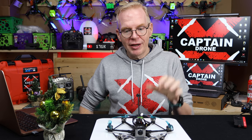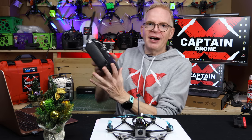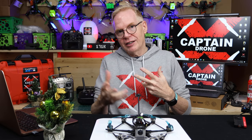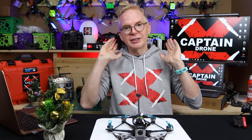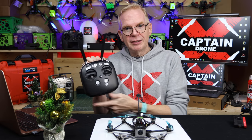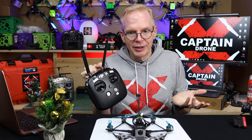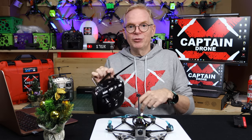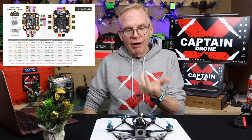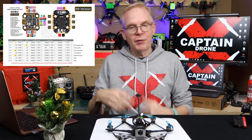Another thing you saw in the video: when I received this Explorer Hex, it had two receivers in it — one for the DJI FPV radio and another for the Crossfire system. You only use Crossfire if you're flying analog and not digital. If you're using digital, you probably default to using the DJI system. But if you want to go farther, you add the Crossfire module. It has seven UARTs on the flight controller and both receivers are right there — you just pick which one you want to use. It's that simple.